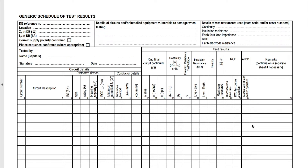What I've got open here is a generic schedule of test results. We're required by BS 7671 that if we do a board change, we're supposed to fill out one of these documents — a certificate, an electrical installation certificate. Prior to that, we're supposed to conduct a condition report to ascertain whether the job is actually fit for changing a board and if there's any problems, but quite often we're under pressure because the customer doesn't want to pay for such a service.